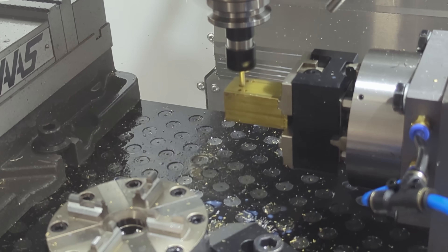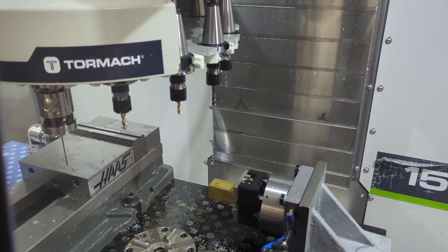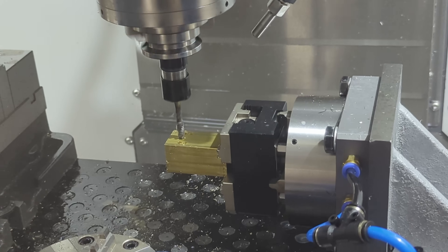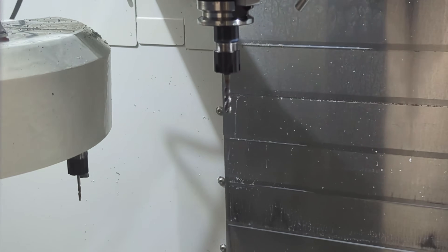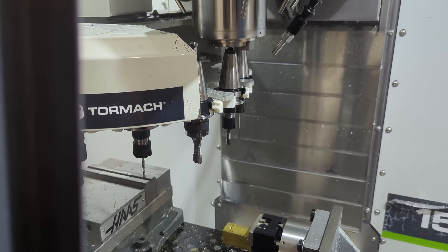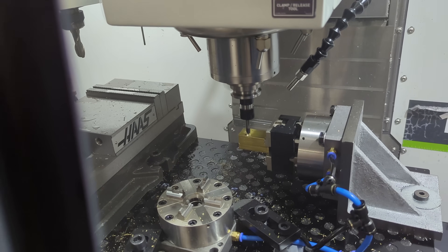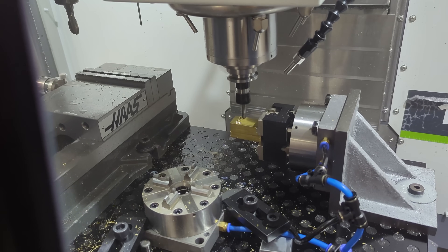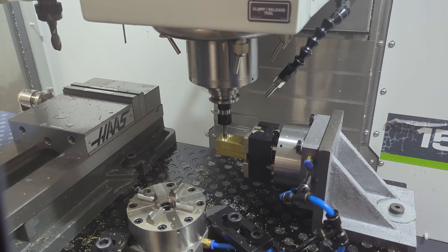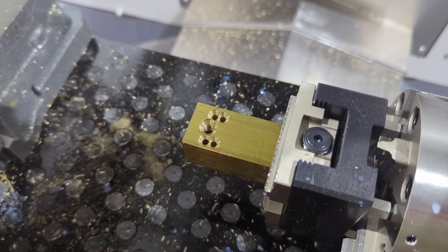This hole might be a little bit small for this tool — bit of vibration. That was a pre-tap hole; now we're tapping quarter-20. Normally I'm afraid of rigid tapping but that was pretty painless — I guess I should be less of a pansy. And now deburring. It's chamfering a little bit deeper than it should because I didn't take into account that there's still stock here — that stock gets removed in the next step. So we got some deep chamfers but it's brass, it's fine. That is the end of the first program: basically just some holes drilled and tapped and some ugly deburring.